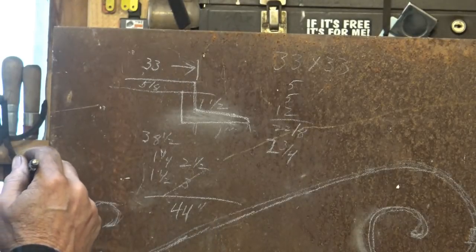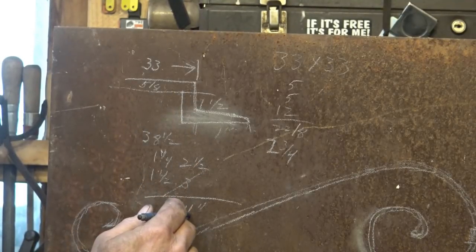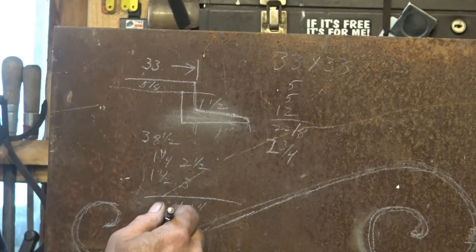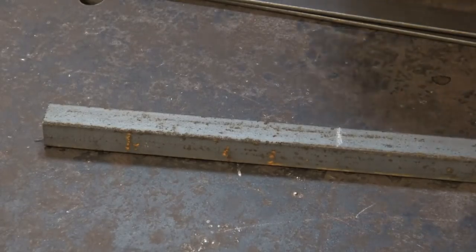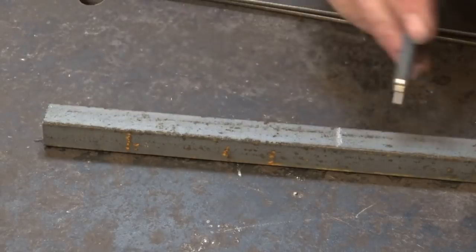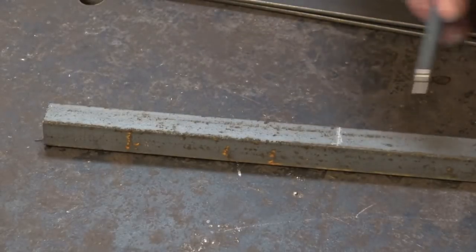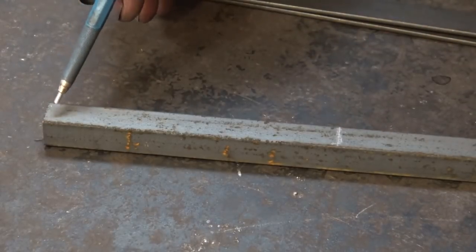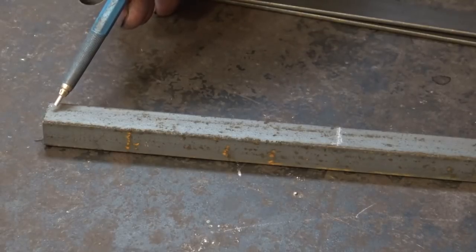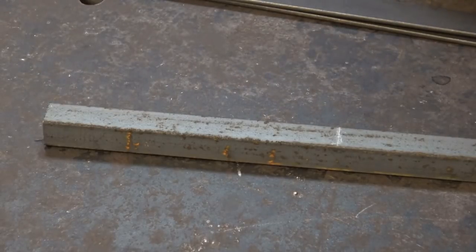Until I do this corner, I don't know if I'm right. A good way to do this is a short test piece, or we can cut it forty-four inches and do it and see if we're right — and if we're wrong, we'll cut another one and do it correctly. If it's just a little bit off, there are ways we can make some adjustments. Now I have my five-eighths square bar. I've cut it forty-four inches, which is my estimated length. But instead of starting from the end, I actually started from the middle and went out, so this is my thirty-three inch reference from the other side based on a middle measurement — that's sixteen and a half inches from the center. Because where this ends up is much less important; if I end up with a mistake out here, I can draw it out further or trim it off.